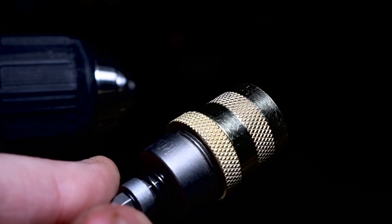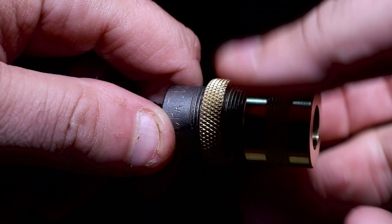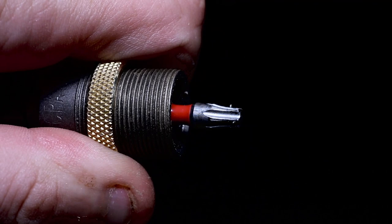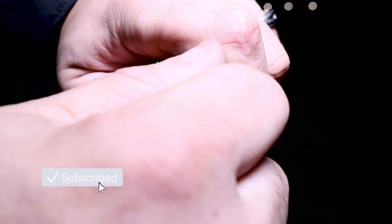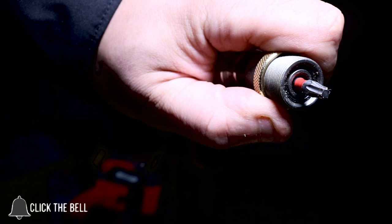I do like that spring on the back — it's going to prevent you from damaging your drill or impact driver. As for ease of use, it's really simple to use, really simple to get your depth adjusted, and really simple to keep it there. I would not suggest using the Phillips bit that comes with it — it's junk and will strip out immediately. I would also suggest you do not use the Milwaukee bits because they're a little too snug and hard to get out. The Makitas work very well with this attachment. The other thing I would have liked to see is the magnetic ring — not sure why they did not put it on, it's a little bit of a disappointment. But all in all, if you can magnetize your bit, you won't have an issue.